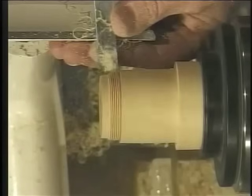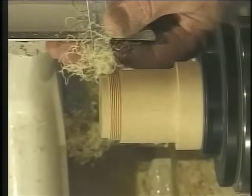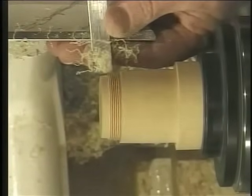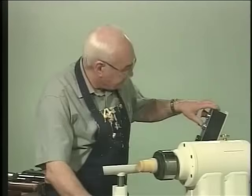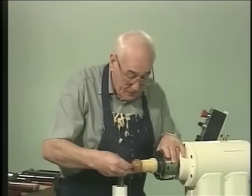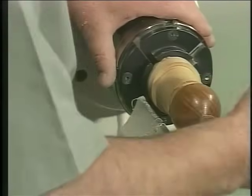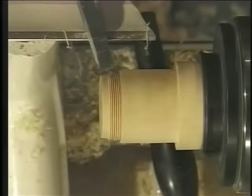And I see that I've left just a little too much wood on here. There isn't a witness mark appeared on the spigot yet. And I don't want to go any further with the chaser for fear of stripping the thread. But we'll just have a test fit first. The thread's just picking up, so we can reduce it now to size and complete the thread.